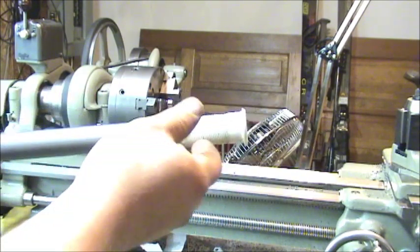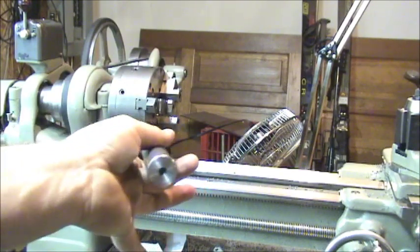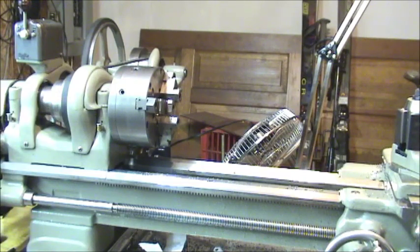The one I made is right here — this is just a protective cap I made to protect the machined area. It's one inch in diameter. The only problem is you need a steady rest to machine the centers in the ends, because the through-hole on the spindle of the nine-inch lathe is only three-quarters inch. So I'm going to use a piece of three-quarter inch aluminum stock to show people who don't have a steady rest how it's done. I'd prefer steel since it won't gall or dent as easily, but I have a lot of three-quarter aluminum lying around.